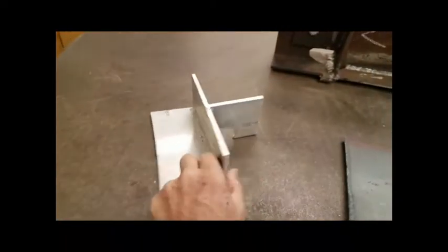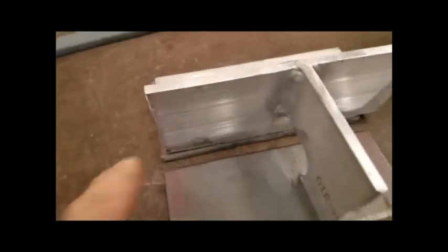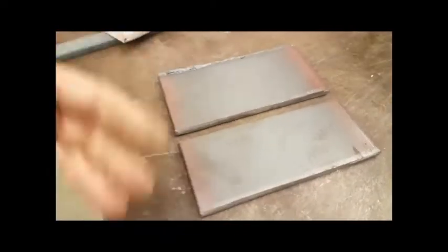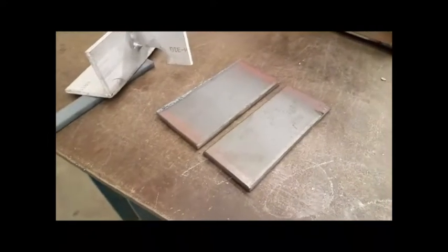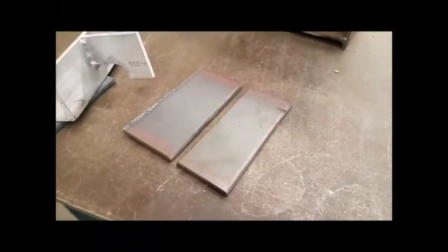So that's the setup. I've taken some quarter-inch aluminum, tacked it together. That square edge is flushed out. We clamp that with our quarter-inch gap in there with a backup bar underneath it. We can weld that, pop it off, cut the backing bar — so that's a great setup for a FEMA 350 test.